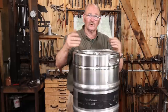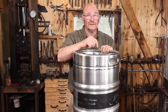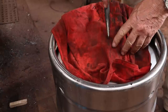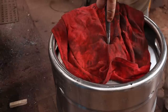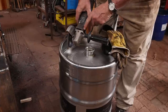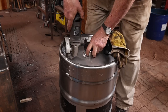They ship it up to a higher altitude from wherever it was, so I've got to vent the pressure. It probably also has a little bit of beer left in it, which is going to stink. So we'll take care of venting the pressure off of this, then we'll take a look at cutting the lid off. After watching a few other YouTube videos, it looks like the thing to do is put a rag over this so any beer that spews out doesn't hit you in the face. I'm using an angle grinder that has a rear handle position, and that allows me to hold on to the valve as I work around this way, get a cleaner cut.